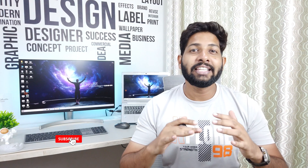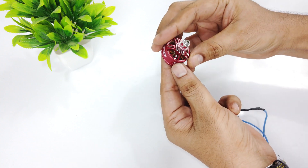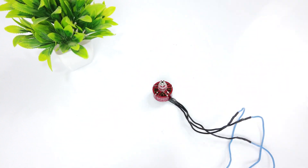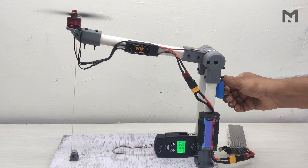The first step is calculation of the drone. Since we are going to make this drone compact, I will be using a motor which has a prop diameter of 5 or 6 inches. I will be using the Racerstar BR2207S motor since it gave me a thrust of 900g during testing. You can check the testing video by clicking on the i button.